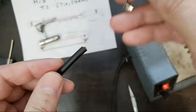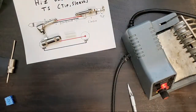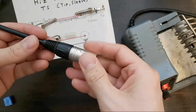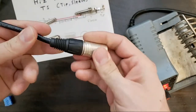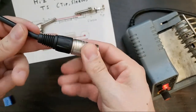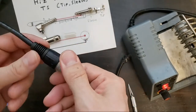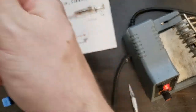You'll see it on all kinds of cables. Another example of strain relief, maybe a more obvious example of strain relief, is this rubbery connector, or this rubbery boot here. So as that turns or pulls, it gives varying amounts of strain relief so that your cable doesn't kink and cut off right at the tip where it would connect here. Strain relief, important.